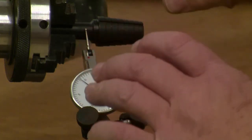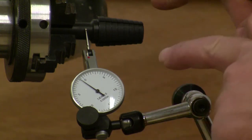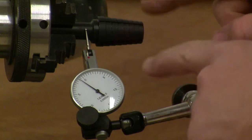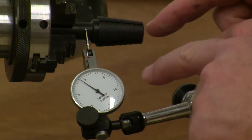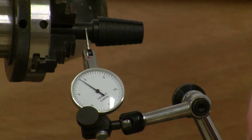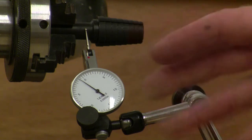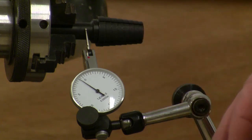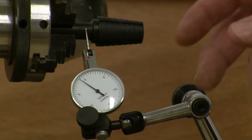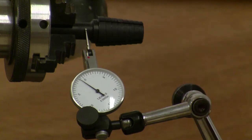If it was concentricity, back on the drawing, we were looking at the center lines. So if it's 6 thousandths, the difference between center lines is 3 thousandths. Which is starting to get enough that could cause you some issues with rings. I would say if you start getting into the 3 to 5, that's probably not going to be good. So now we'll mount this same mandrel up to a different setup and we'll take another measurement.